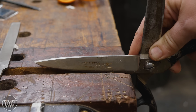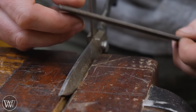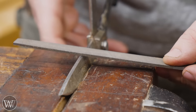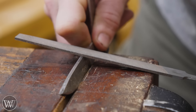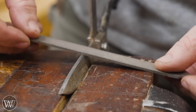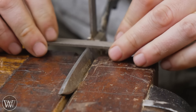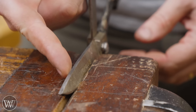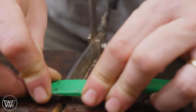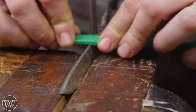I like to do it in a vise, though sometimes I'll do it freehand. I'm just going to put it in here and clamp it down. If you're new to sharpening, you might find it a little bit tricky to get the right angle on the file — you want it to match the current bevel. You can move it up and down in the vise until you find that bevel, so you can rest it on the back and just move it along with the correct angle. With a file I'm just going to do draw filing, pushing it along — it usually only takes a few passes until you get a slight burr on the backside.